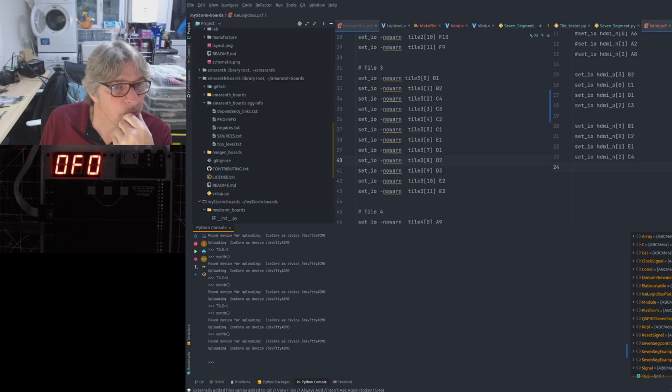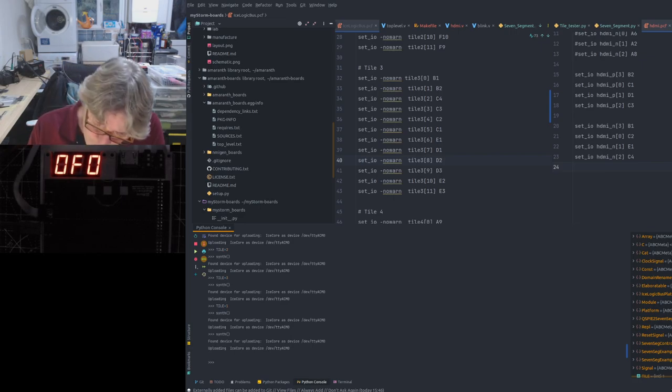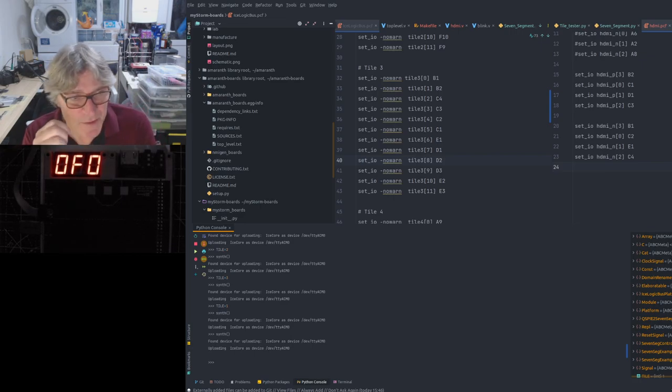For me, the USB would be for a USB joystick. So it would be a HID device, wouldn't it? So you'd want a host connector on it, like a USB-A, I guess. And we could put a couple of those on a tile without a problem. In fact, we might be able to do a couple of hosts and something else, depending on height.